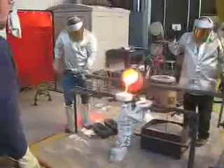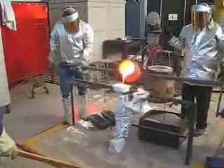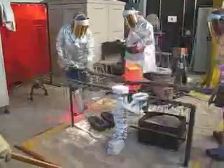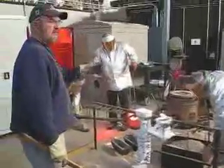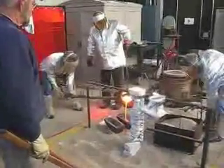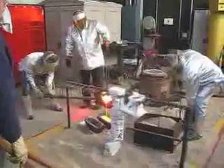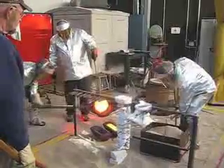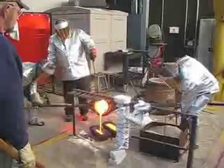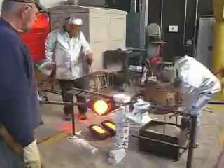If there's any moisture in the molds, the bronze will come out like a geyser — it's going to turn to steam. If there's any moisture whatsoever in the molds, it'll turn to steam and start blowing the bronze up, and it's a very dangerous situation. So it's really better to wear long sleeves. These ingots are just for re-use again. You've heated quite a bit more metal than you need. It's always better to have one ounce too much than one ounce too little.